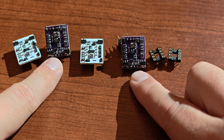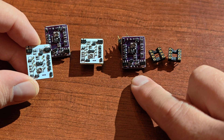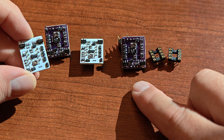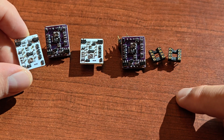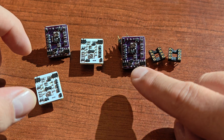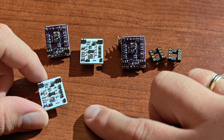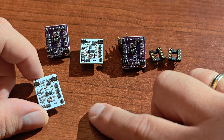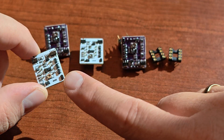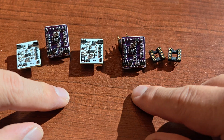I tested the dual ones in Class D amplifiers I own, and the single ones I tested with a preamplifier — a clone of the Accuphase C-3850-S, the review of which will be coming very soon. Although dual op-amps are more common, some constructions use single op-amps, mostly those using the integrated NE5534, and these would be excellent candidates for replacing the NE5534. I highly recommend them, as I did the LC5.